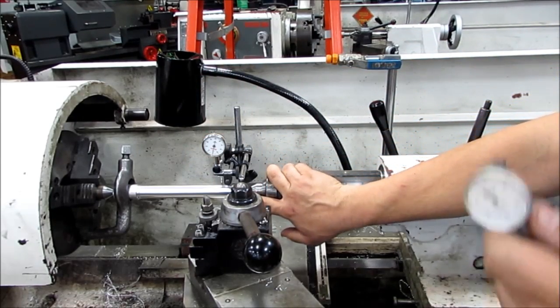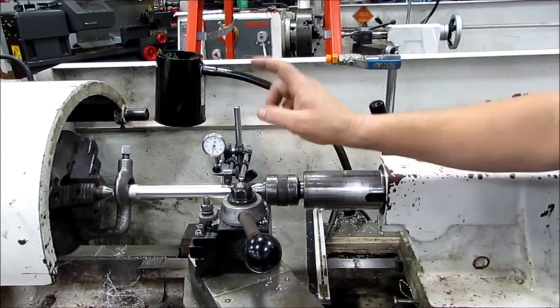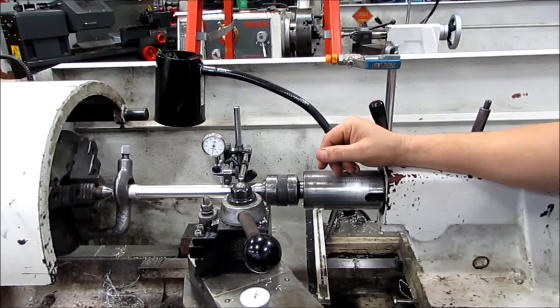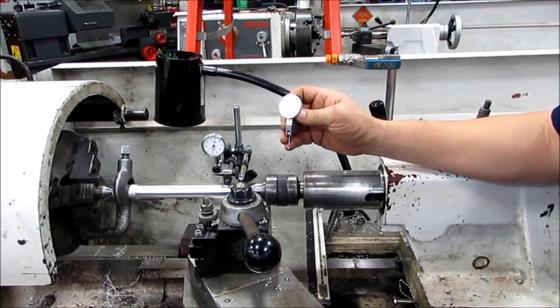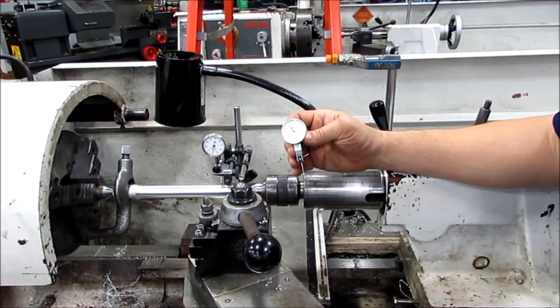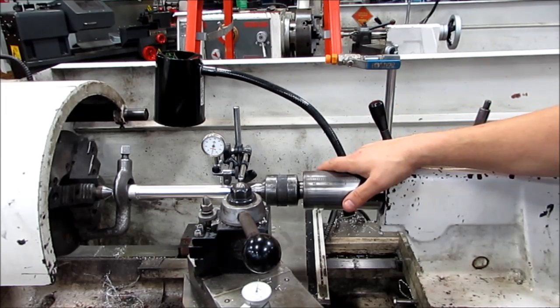I've given you three methods today: one is the zero to one-inch travel indicator, one is the micrometer reading, and one is the button-back indicator. Of these three, probably the most robust is the button-back, though not everybody has one. Everybody does seem to have a one-inch travel indicator. If you don't like that, you're welcome to use a test indicator on the same general setup. Thank you for watching. George Love, Texas State Technical College, Precision Machine Technology Department — this is how to indicate a tailstock center.